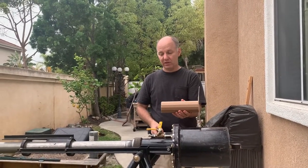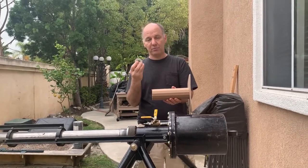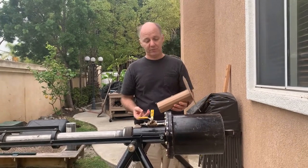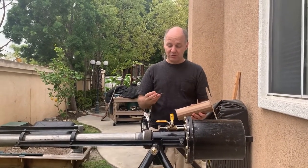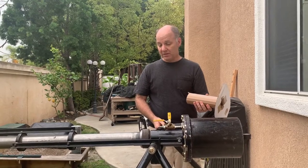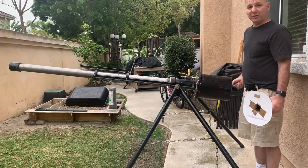Instead of a valve opening slowly, in a very short period of time the face of that die is flat, it punches the hole through the aluminum, and all of the air immediately flows out. To improve flow, the inside of the cone is necking down to the barrel diameter, so it tries to get decent flow, and it seems to work pretty well. This 25-thousandths aluminum is okay all the way up to about 500 pounds per square inch, and because of the surface area of the piston it'll fire as low as about 20 pounds per square inch. It's been really reliable over the last almost 30 years and almost never fails to shoot. Hope you enjoyed the little presentation.